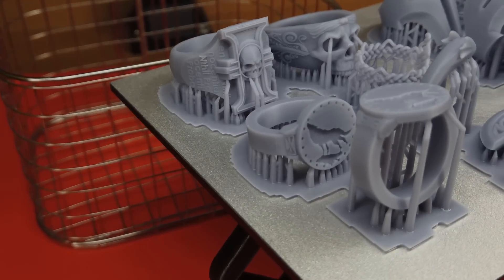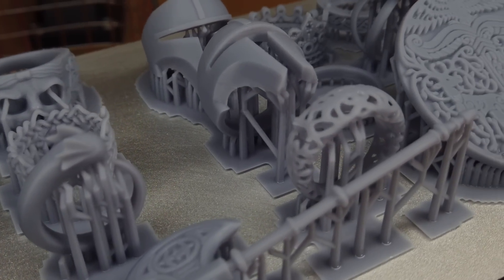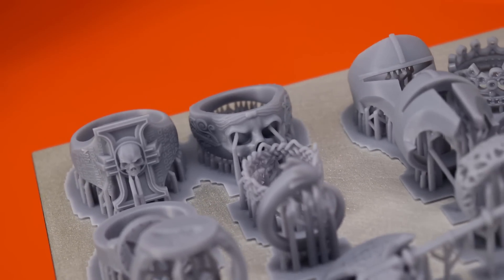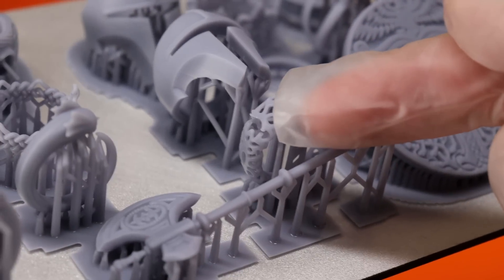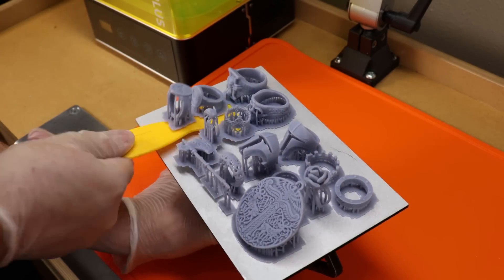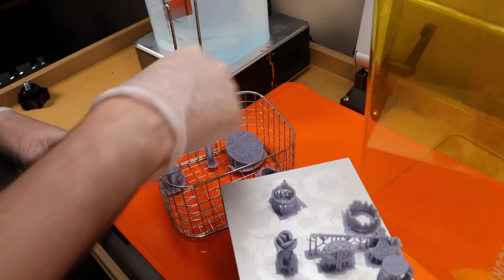Here's a full plate of prints that are all different types and styles of jewelry, just to see how the printer would do with each one. I could have probably fit them on a little bit better, but this should work. The detail on a lot of these came out really crisp, but there are also some failures on some pieces. The failures look like they're from not having supports in the right spots, and some looks like bad layer adhesion — so I might need to increase the exposure time per layer. All in all they came out pretty nice, especially using the same settings for all pieces and this being just the second print with this resin.